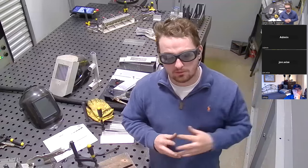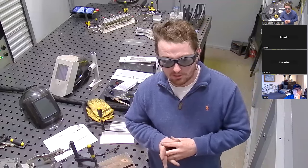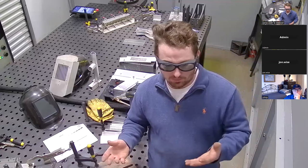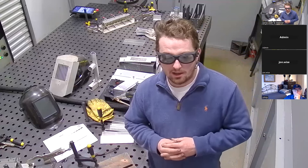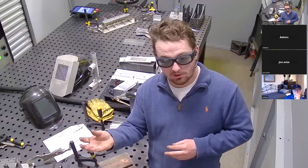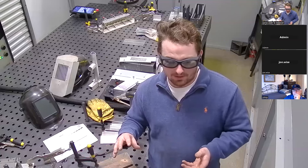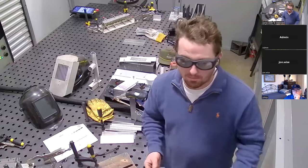As for what it does to the skin — the infrared radiation the laser produces won't really do anything to the skin except heat it up if it were to hit it, which can cause a burn similar to a burn from a flame. The UV radiation radiating off of the molten material can give sunburns, but the sunburn risk is much less because there's a lot less UV radiation than there is with a MIG or a TIG. If you're around MIG or TIG welding aluminum especially all the time, you know how bright that light is. This is not nearly as bright.